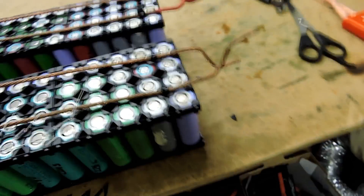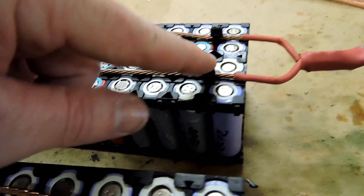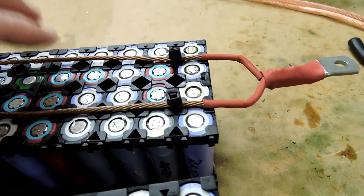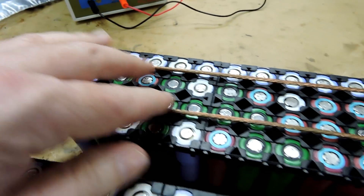This is my little test one. I put the knobby bits of the zip tie on the outside rather than the inside, and that's just so I've got actual standoff. When the fuses are here and I put the cell down — which I often do — it provides a couple of little stands to protect those fuses a bit. So let's get this happening and see if we can spot weld this baby up.